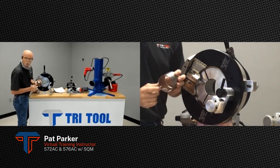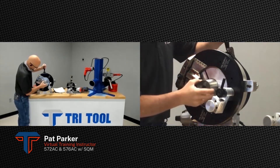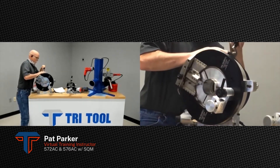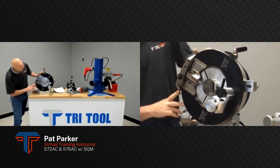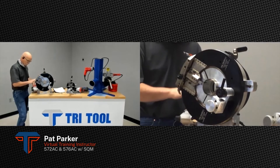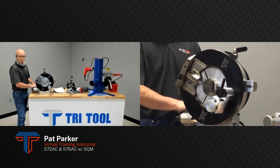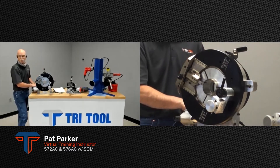It's 093 wall, electro-polished. We get our cam in, take out the backlash, set at three thousandths per rev, and engage our tripper pin. The difference with this machine besides the size range is that it can also go up to 0.156 inch wall thickness. It has a larger Milwaukee motor on it, unlike the 572 which has a Metabo drill motor.